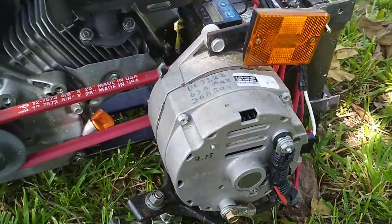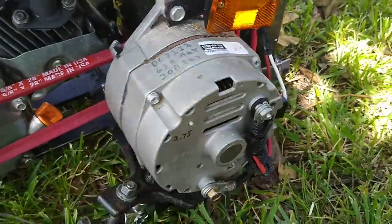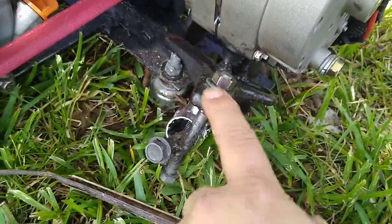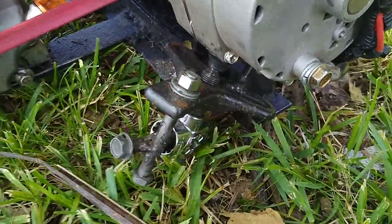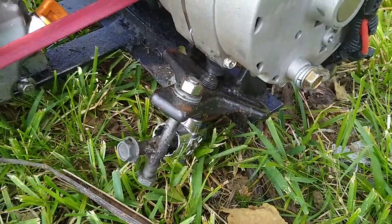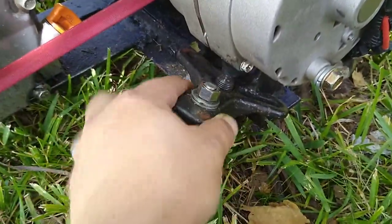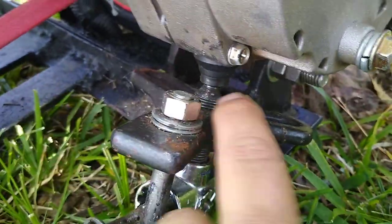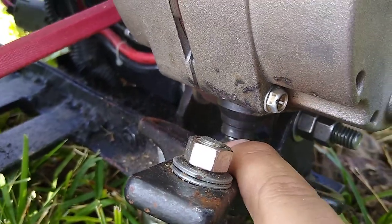Some of my other original videos, you saw I had a spring that was trying to pull this alternator tension-wise. That just did not work. So what I did here, this is a puller that I was not using. You'd use this to pull like a water pump or brackets off the ends of stuff, steering wheels, different things like that. So it's a nice piece of steel. It's got threads. It's got a nice flat head that this can spin in. And it's pushed up perfectly to it.